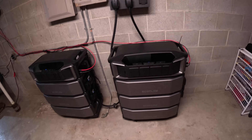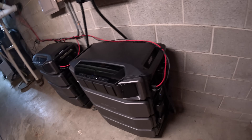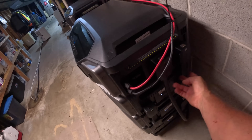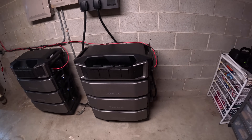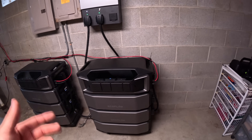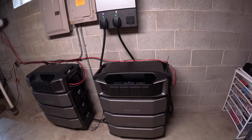Adding batteries is expensive, but the peace of mind — it's so easy to do. If we got an extra battery tomorrow, all you literally have to do is turn it off, disconnect a couple of these big cords, lift it up, put the battery on there, reconnect it, and plug it back in. You could have it hooked up and ready to go within two minutes. Yes, they're heavy — over 100 pounds — and the inverter's like 90. But two people can do it: they've got handles on both sides, pick it up, put it down, plug it in, and that's it.